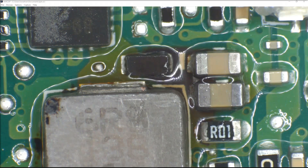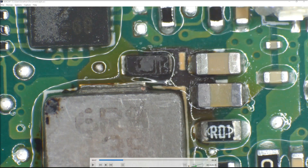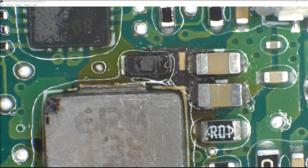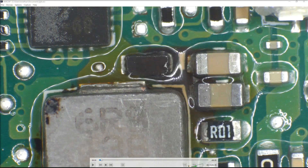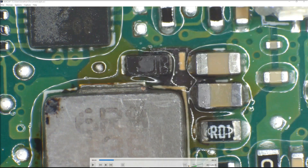I'm just about to inject 5 volts with a limit of 500 milliamps onto this board. This is the section that's getting warm, and I've just doused it in a small bit of lighter fluid. Hopefully that will reveal which component is getting hot and which component has a short. So let's watch the video. Did you see that? It's very, very quick, and you can see a small bit of smoke coming off it as well. Let's watch it again — we can see how quickly the lighter fluid disappears from this capacitor.